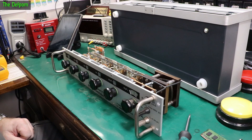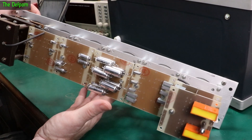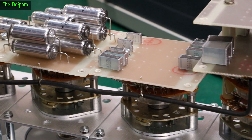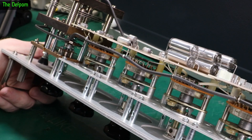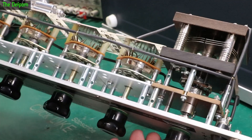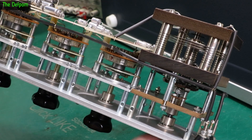I was right — it does just come out the front panel. Let's have a closer look. It's got styrene caps in it, interesting. Those caps there — I recognise them, do you know what they're called? Comments down below. And some more polys here. Interesting construction — very simple, very tidy, extremely tidy construction. And we've got a variable capacitor at the front — it's an air capacitor, an air gap variable, which is how you get these really small values.